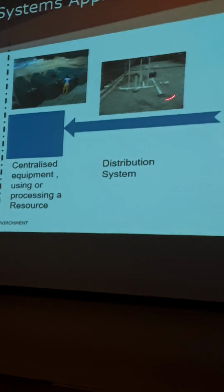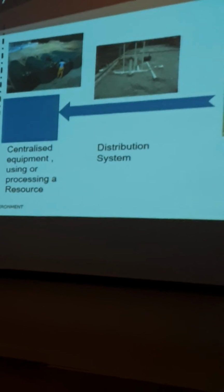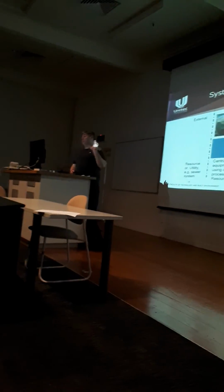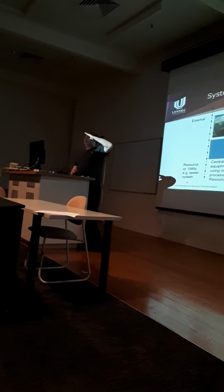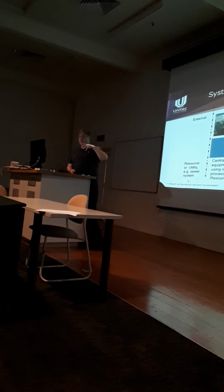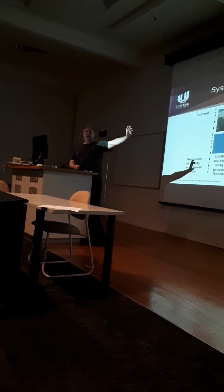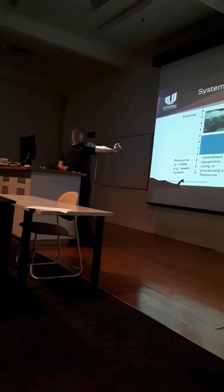Now what tends to happen in New Zealand, because you looked at those gradient sizes of your pipe, even if a fixture only needs a 65 mil or 50 mil pipe in the slab, a lot of plumbers will now use a 100 mil pipe because it's greater capacity, and it also means they can put it shallower. So even if the bath only needs a 65 mil pipe, they'll use a 100 mil pipe. Even a basin, which just needs a 40 mil waste pipe, they'll put a 100 mil pipe in.